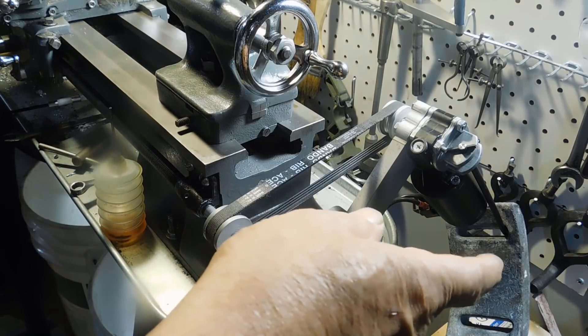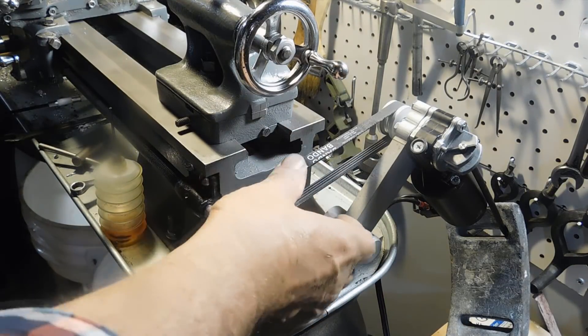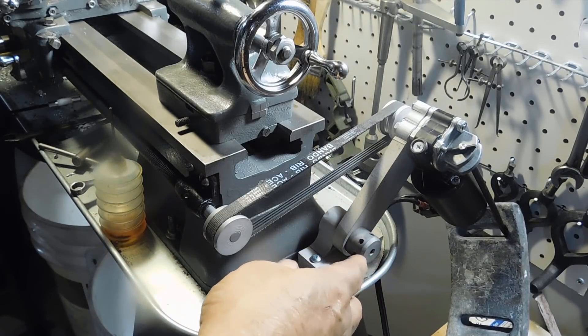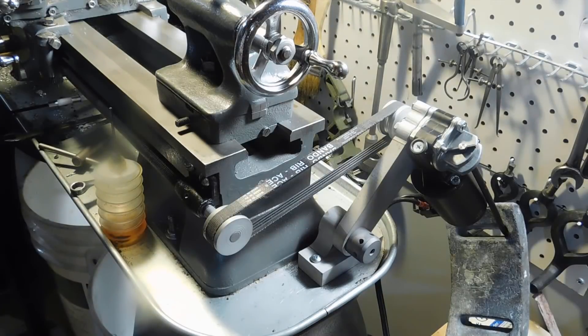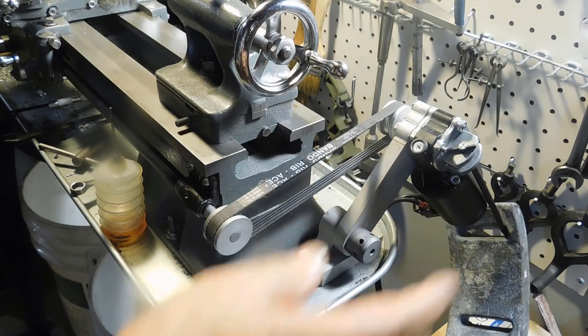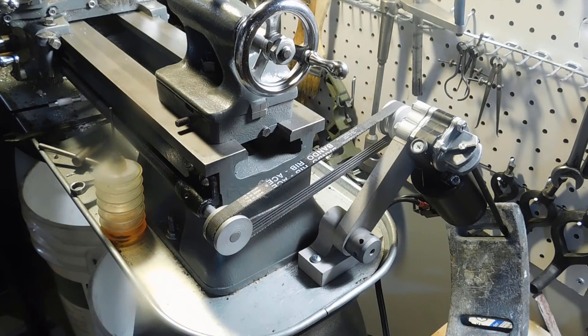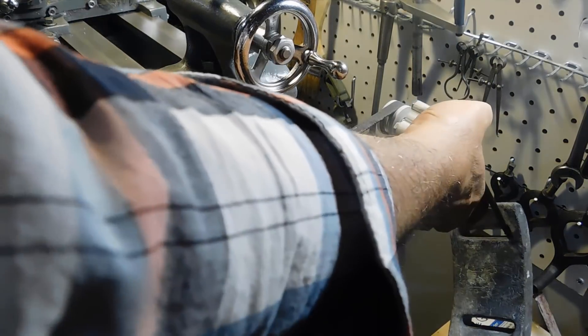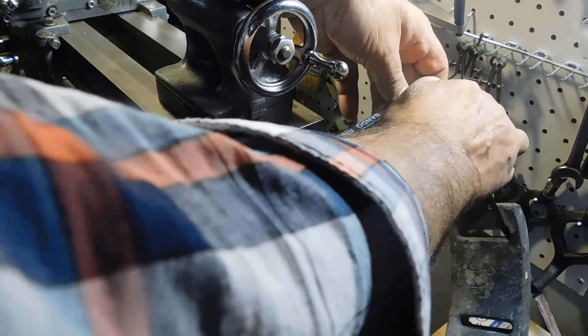The other thing you'll notice is the dive weight on the end of a rod I put through here. I needed more tension on the belt — I couldn't lock it with the jerry bar tight enough, and the slippage was not acceptable. This works fine. I'm a clockmaker, so next time I make some weights I'll replace that dive weight with a proper one. I had some springs, but to be truthful I didn't want to put a spring in there, because now to take the pressure off when I'm not using it, all I do is just drop the belt. Installing it and taking it off is that simple, and it will be even better when I get the new weight on there.